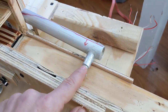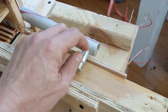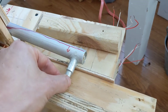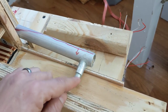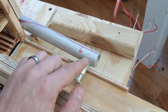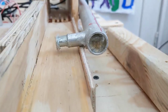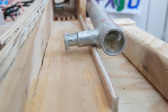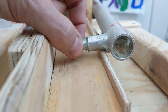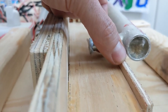Now is the time to add the retrieval arm. Partially retract the linear actuator to about halfway, then attach the arm — originally the plastic cap pieces from inside the actuator, pulled to the outside and extended. Use goop adhesive to fill and solidify the arm. The reason for partial retraction: you know the little lip of balsa wood will be below the arm when it dries, so it won't push down on that strip when fully retracted.